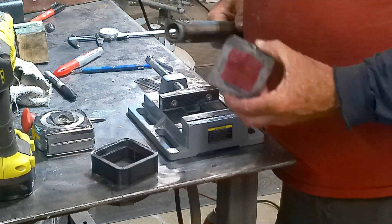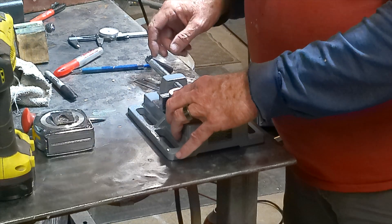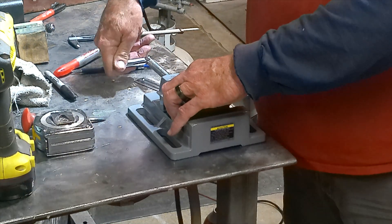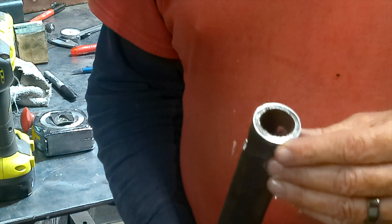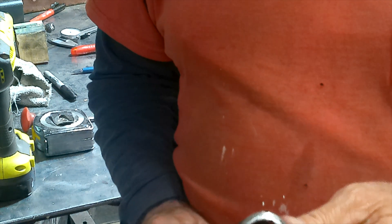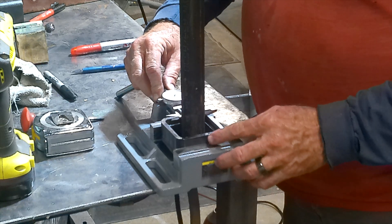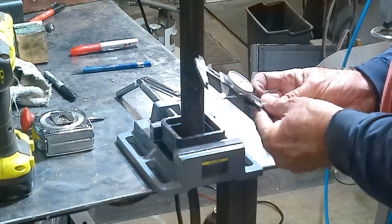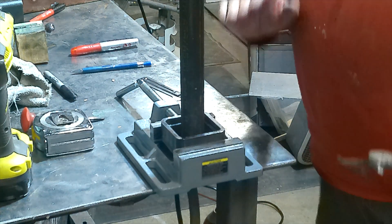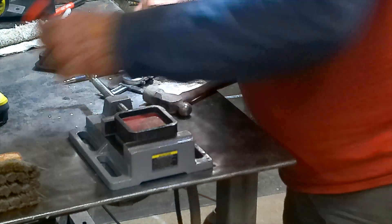Here I have my tail cap — the end the tube protrudes out of — which bolts onto the end of the tail stock. My last vice had the tail welded on, which was a problem; this one will bolt on. To ensure it's absolutely square, I cut it with a pipe cutter. If you subtract half the diameter of the round tube from half the width of the square tube, that value gives you the appropriate distance from the edge that the tube should sit — and you can see it's the same from all sides.